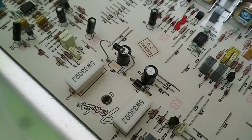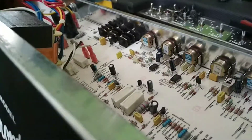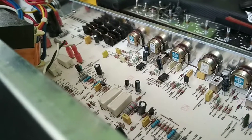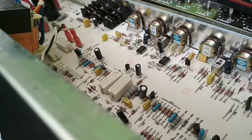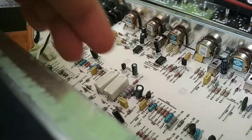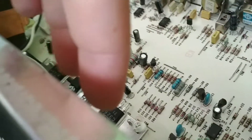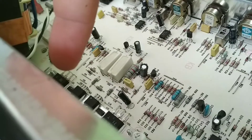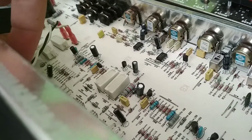They are providing connectivity - there's continuity through the tracks so I'm not going to touch them. The other thing I noticed is that these two resistors here, which are 0.22 ohm - so less than a quarter of an ohm - originally had 22 ohm resistors in there, causing the amp to choke up. These have to do with the output of the amp. You've got these resistors coming out of your transistors here - 50 watts a side, plus and minus - going through this circuitry and coming out of these two wires which are connected directly to the speaker.